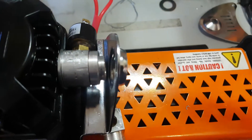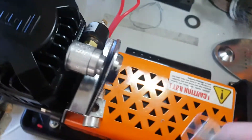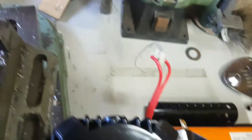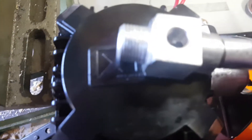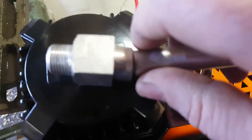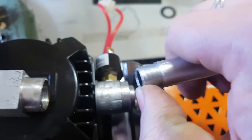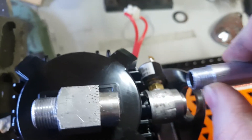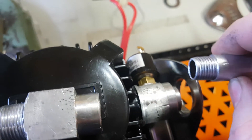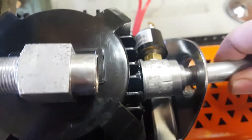I think the issue I'm having at this point is because I didn't have any other tap that was fitting this piece of aluminium, which originally screwed into this block, which originally had a hole in it. As you can see, that doesn't really fit in there. But I'm fairly limited with the taps and dies that I have. So what I had to do was cut off about 10mm of that, then re-tap it — re-thread that at, I think, 1/4 inch BSP. And so that on the new part is 1/4 inch BSP, so that will screw in there.